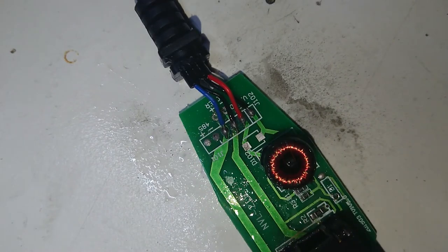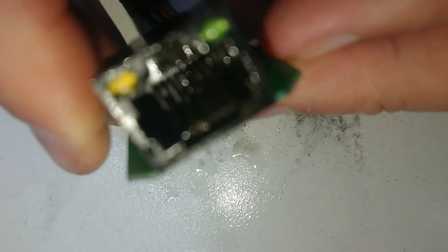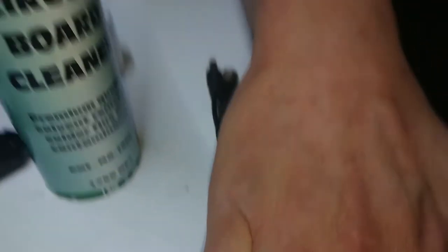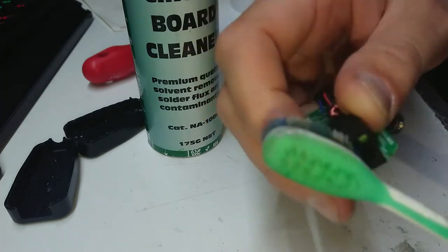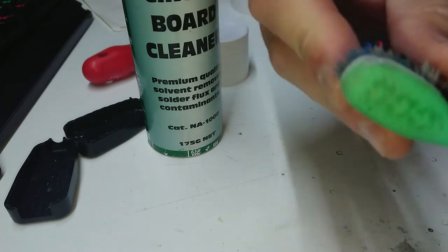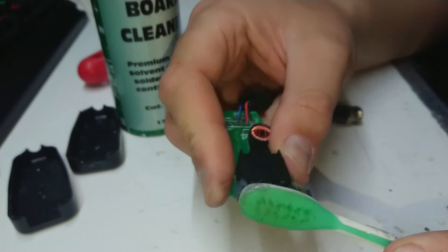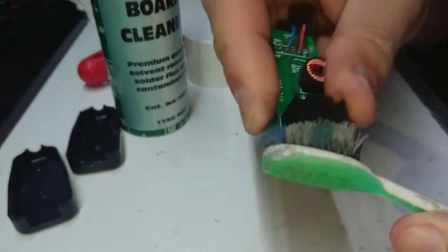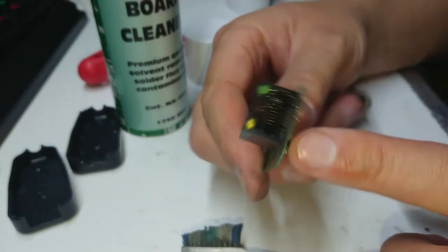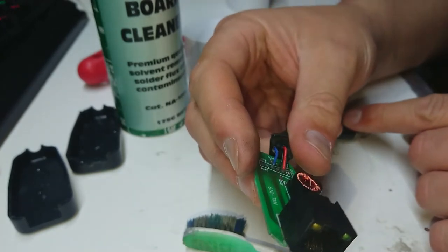It does make me sneeze slightly but that's all good. The bit I probably won't ever get right again is inside this socket, but we can always try. Let's bring the camera angle back up. Give it a bit of a clean — we might get it looking okay. If you're in the field and this was the only one you had, you might actually do it. I notice there are actually two pins missing, so they're not using all the conductors — I think they only need four for functionality. It is sort of clean. We might hook some power up to this and see if it lights up — that'll tell us if there's a short — and then throw it back in the junk box for spare parts.